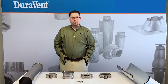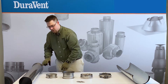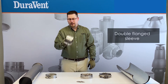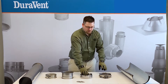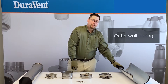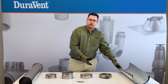Before we get into installation, let's look at the components that make up a variable length. First, our inner wall sleeve, our single flange retaining band, double flange sleeve, inner wall locking band, standard V-band. For double wall applications, two half outer wall casings with hardware, and for insulated product, a strip of insulation will also come with the assembly.